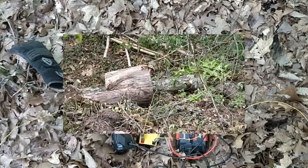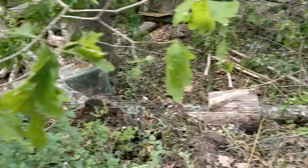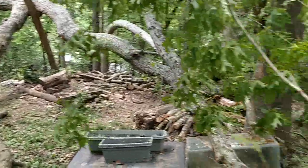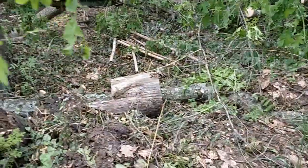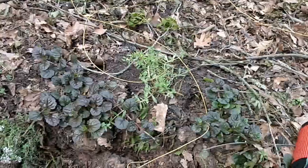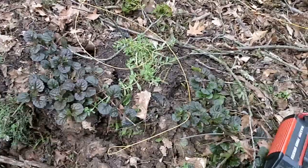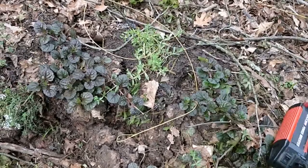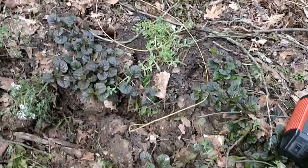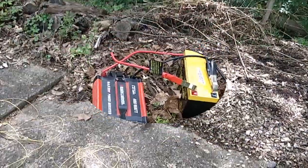After going around the complete back and fixing a few weak joints, we had a tree fall last weekend. I found the wire pulled under one of the fallen branches — a complete break. That was the major malfunction. It was intermittent sometimes depending on rain and humidity, but now it's completely open. That several-hundred-kilohm reading was probably just my finger resistance. Let's fix this — we're almost done using the portable kit.